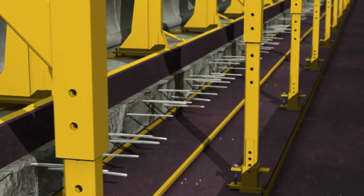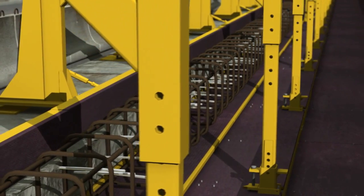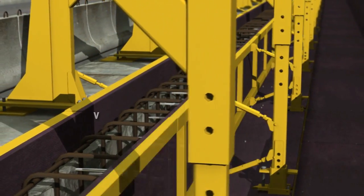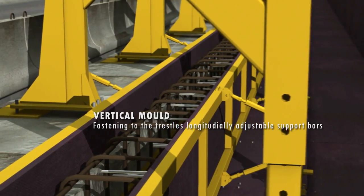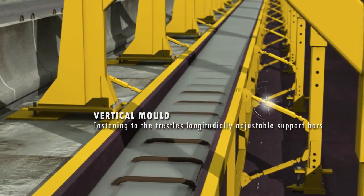After the base mold, it is time for the vertical mold. Its lower surface will be placed level with the upper level of the deck. After this, the edge beam will be iron mounted and the vertical mold outside will be installed. Now everything is ready for casting.